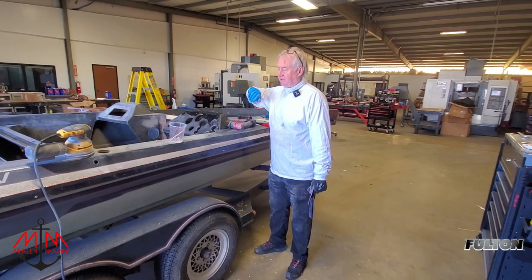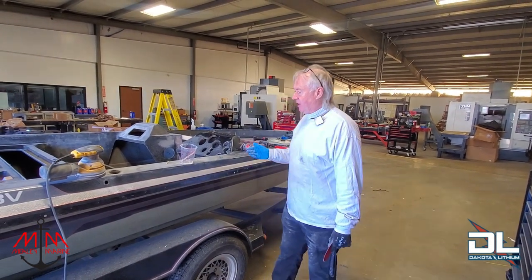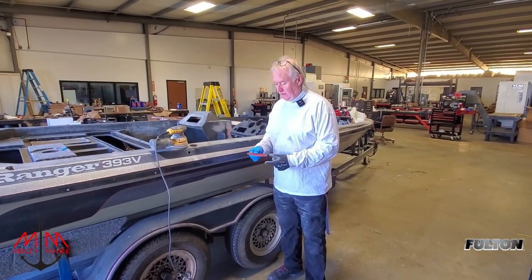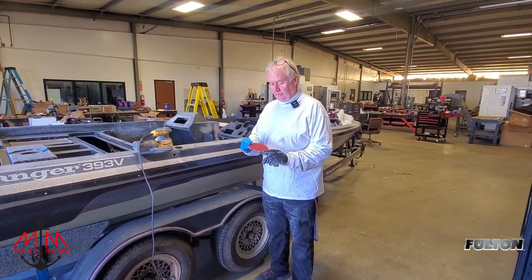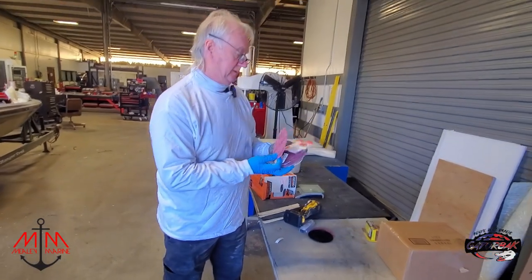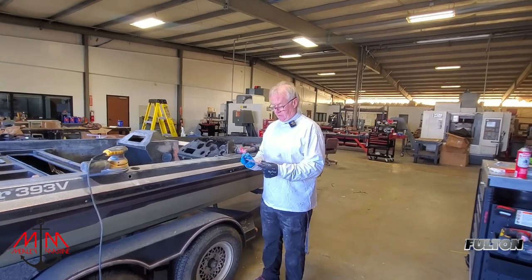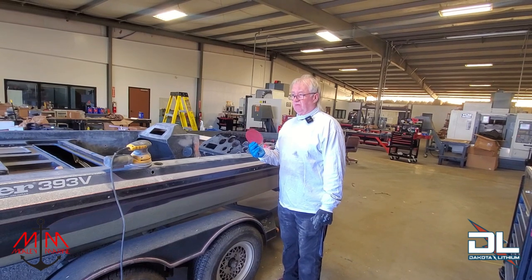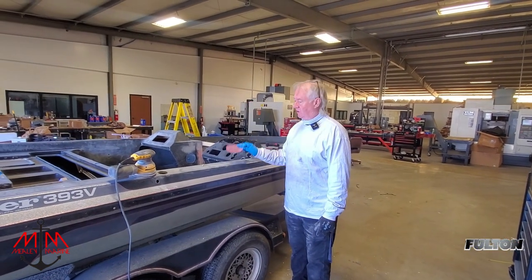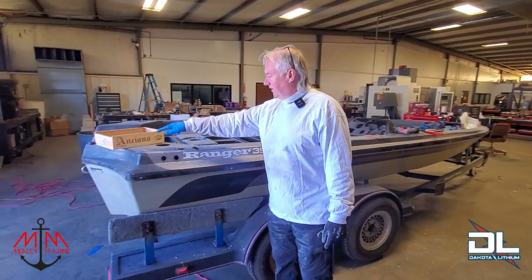We filled the holes up here — there's video of that. We filled them no differently than before: epoxied, stuck the holes in. Every time we think we've got all the holes filled, we find more — but that's just part of it. Michael got me some Sandnet sanding pads. At Home Depot they work out to about a buck forty apiece, which is kind of expensive for abrasives, but they work really well. They're excellent here because we're clogging up — you'd go through three regular ones for every one of these. We've also been filling more holes in the back.